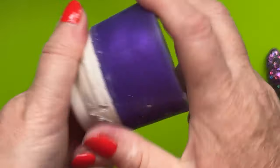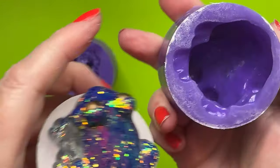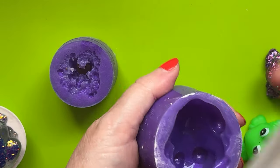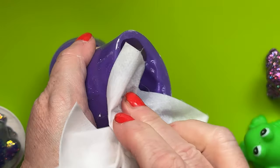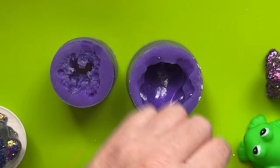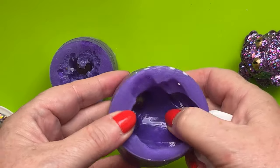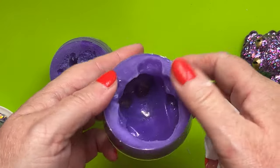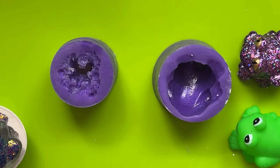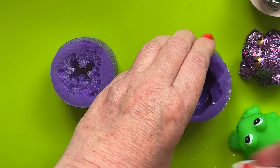Silicone doesn't like plaster so it'll come away from there quite easily. You won't get the glossy perfect finish on this side probably, but okay — here comes the frog! We have liberated the frog. Let's give that a wipe up — as you can see, it's shiny in there, whereas my original frog wasn't. That doesn't look bad around the top either. I'm going to give these a wash, make sure they're nice and clean and there's none of the plaster in there, and then we'll get some resin in there and see how they come out. That's going to be slightly textured because I painted these frogs with UV resin, so it might not be perfectly smooth but it's a lot shinier than the original mold, which was completely matte.